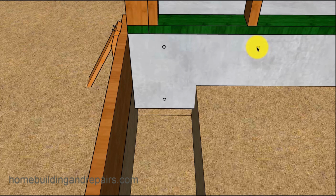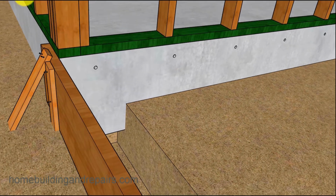I don't want to say that you need to center these, but you would probably want to center the top of it, because you're going to be putting another piece of rebar on top of this, and you don't want it to get too close to the surface, and you don't want it to be too close to the soil. And I believe we need to be at least 2 inches away from exposed soil for that. So we got plenty of room.